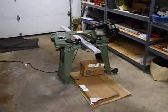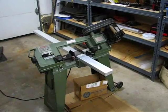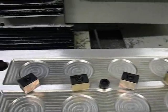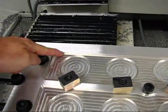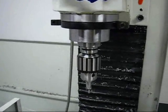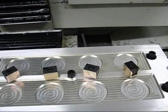While the aluminum is cutting in the background, the second piece of bar stock I've cut here, I figured I'd show the fixture setup. The band saw is about to finish cutting the second piece of stock. The way this is designed, you have to have two pieces of stock to run each part, or to run a batch of parts. I've got the wiggler set in the mill spindle and I'm getting ready to run that setup.